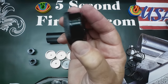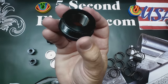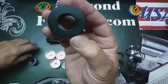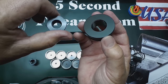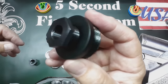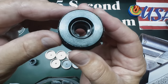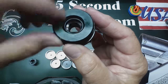The attachment cap is 18 millimeters thick out of a solid single piece of 6061 T6 aluminum, and it does have its bevels on both sides. We also give you two fittings. This is the 1/2 by 28 that fits right into the end cap, and you can see where your bevel flushes out so that it doesn't block any of your solvent from coming down, so you get no flush back.